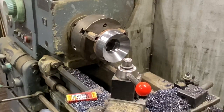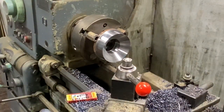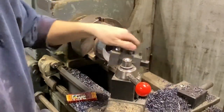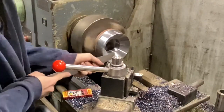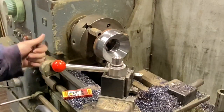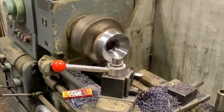This doesn't need to fit perfectly — it just needs to cradle the bell and hopefully center it. I'm coming back on my French bead comments — I'm going to make this mandrel perfect for a standard bead first, and then if I need to adjust for a French bead individually, I'll do that. I'm going to use my CNMG tool to rough it in. I also want to add a little draft to the face of the mandrel — tapered this way — to prevent bells from getting stuck on it.